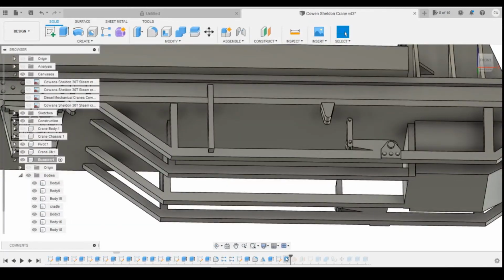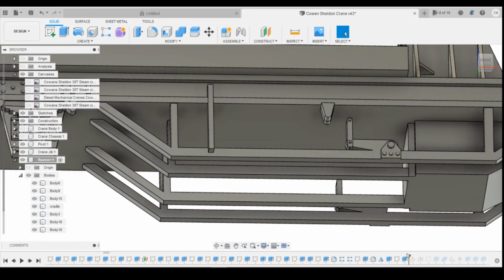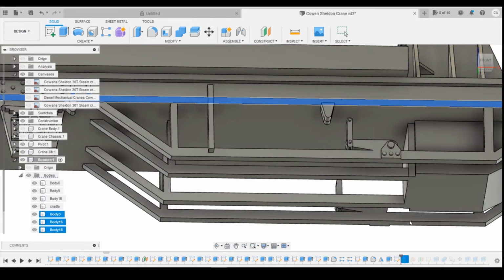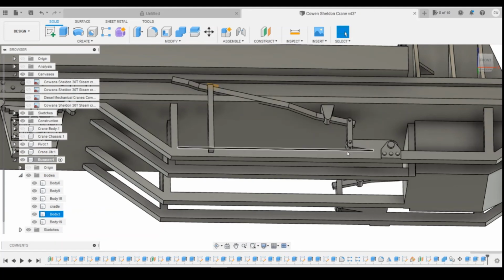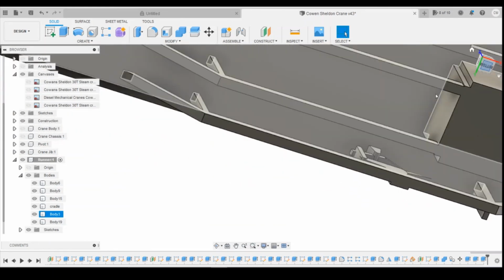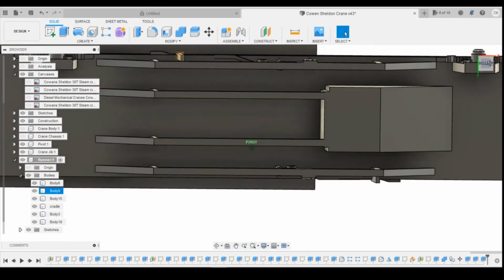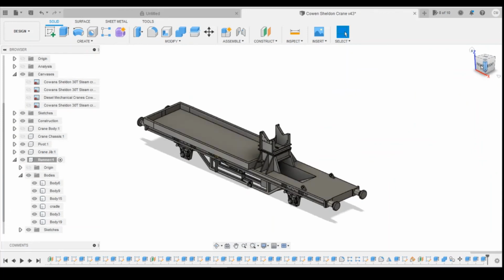Okay, so I found the issue is where we've extruded this and changed some things. If you look at this sole bar thickness here, it changes at this point. This one here changes the thickness of the sole bar. So I'm going to delete that feature and jump back to the end. That's now recessed. There you go, problem solved. Simple things that, you know, sometimes you do one change and inadvertently change something else that changes your original part. Okay, so let's have a look at both sides.